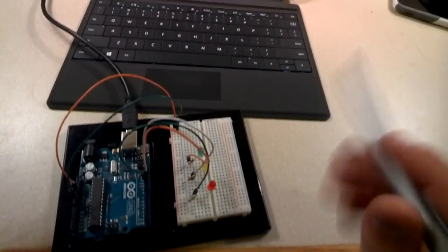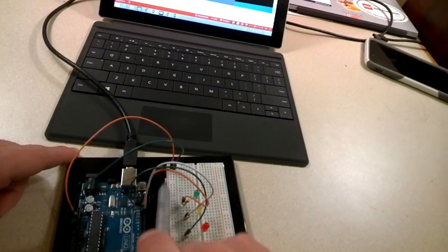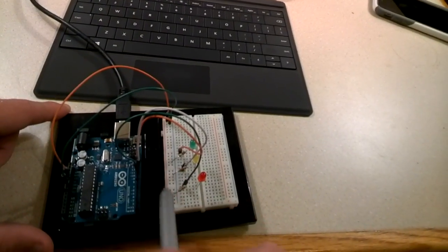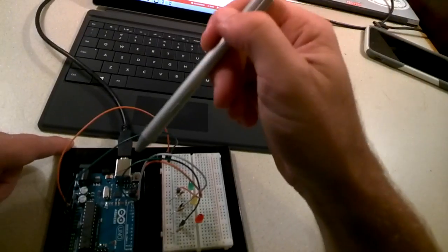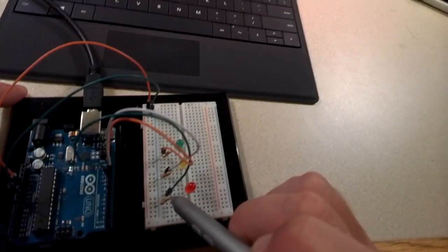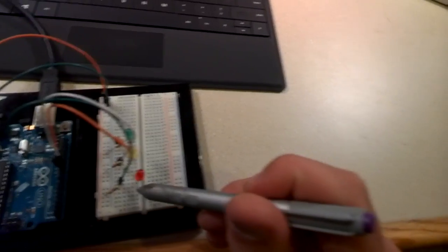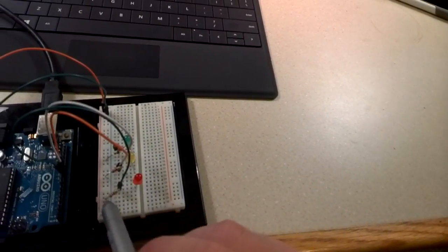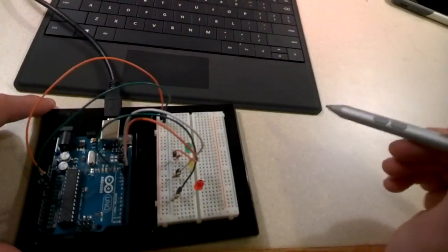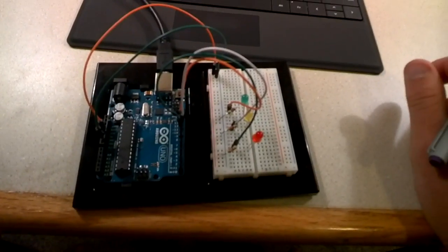So what happens in our complete circuit? Electricity is going to be powered, in my case, from my computer. Positive and negative, it's going to run through here. All right. It's coming down. My ground. Positive is flowing through to this. In this case, let's follow the path of LED light number 10. It hits here on strip number 25. It shoots down. It's going to flow up the positive leg. It's coming down through, hitting this, running back, completing the circuit back to here. And that's all happening. All right, so we've just made one big circuit, essentially, is what we've done.